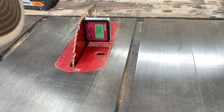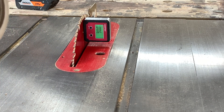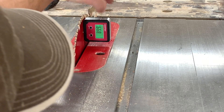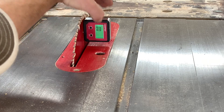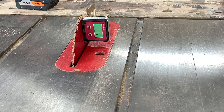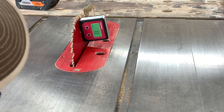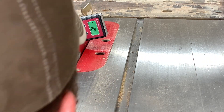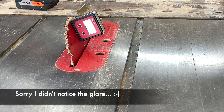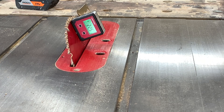Where this really comes in handy is doing bevel cuts. So you go over here to your bevel wheel, and say you need to get a 22.5 degree angle. I reset it right here so it will read at 0.0, and then you can easily dial this in — and you can hear I need to lubricate this guy a little bit. Say you're going to do a compound 45 degree angle and you're going to cut to 22.5 degrees. You dial that in, lock down your table saw, and you're good to go.